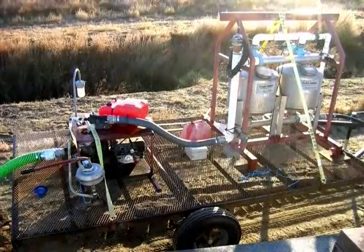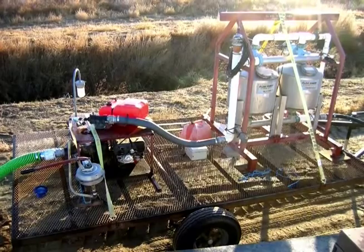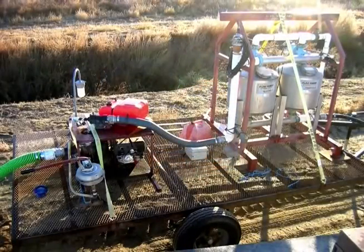This is nice because we're taking a portable system and mounting it on a trailer. If you have a creek or a river you want to pump out of, this is the cat's meow — because if it's going to flood, you just hook it to your four-wheeler, pickup, or tractor, disconnect the intake, and take off. Get it out of harm's way. The nice thing about this system is it has a little pitcher pump to prime the pump, then you've got your filtration, everything right in one place. You can buy these already assembled, or as this gentleman did, make your own.